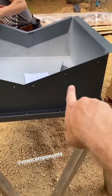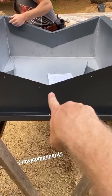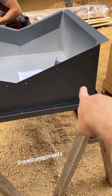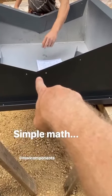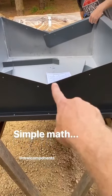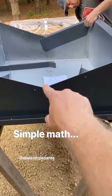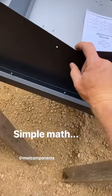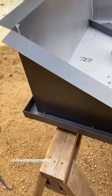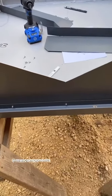This is a three-foot cupola, which means from here to here is 18 inches. Going from a 4/12 to a 6/12, I need to add three inches to this pitch. Hopefully that makes sense — one foot is two inches, two foot is four inches, therefore one and a half foot is three inches. So I'm going to measure down three inches and that will be my new pitch line. There you go — cut down to a 6/12.